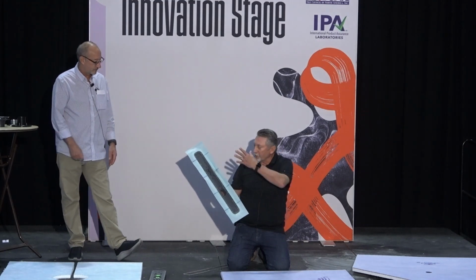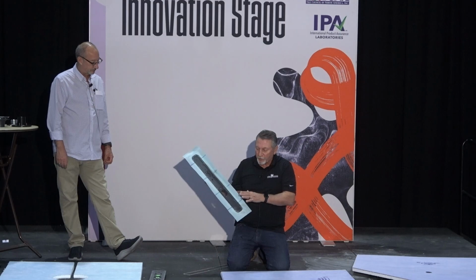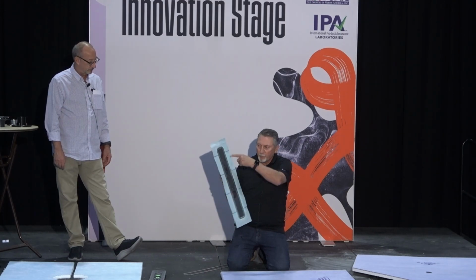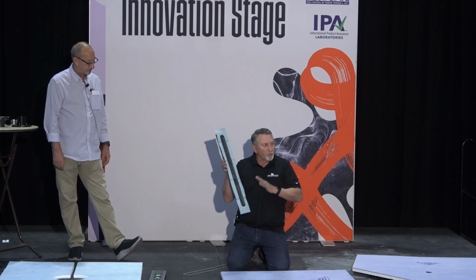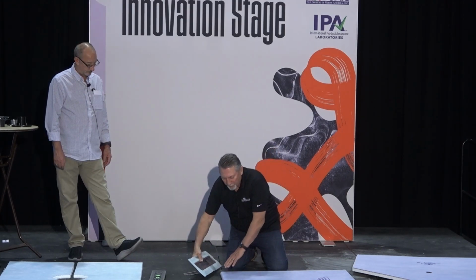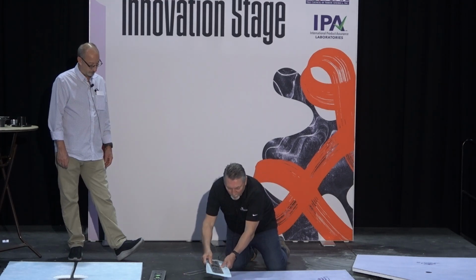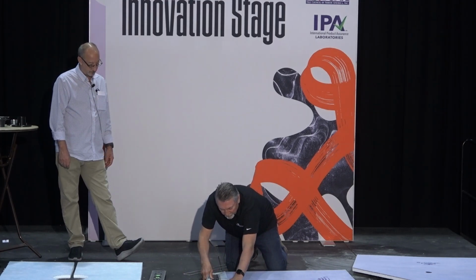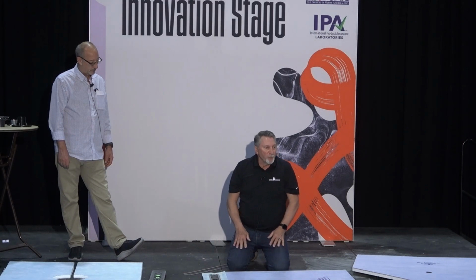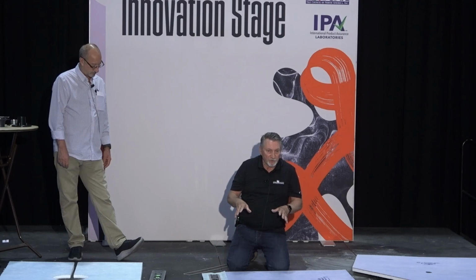Like Eric said, we also offer our drain with pre-attached flashing, but we still have the clamping ring. If you order that drain that way, and the base with the waterproofing on it, you would simply cut that flap off, and then once the drain's in, seal that flap down to the membrane with our 250 sealant. Again, that is a lifetime warranty on that system.